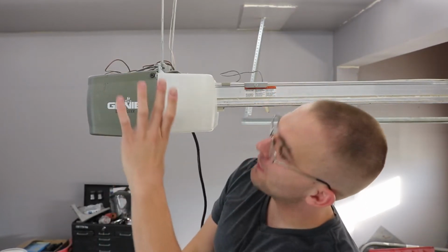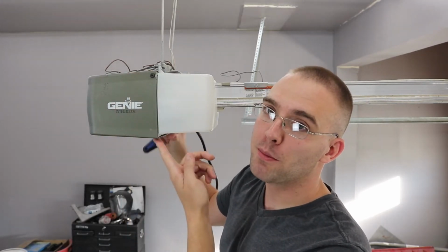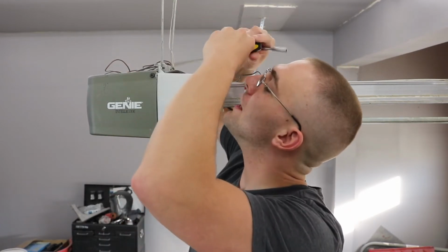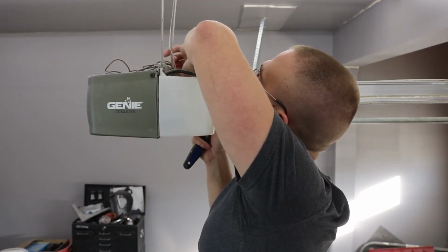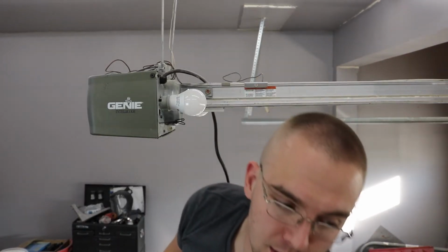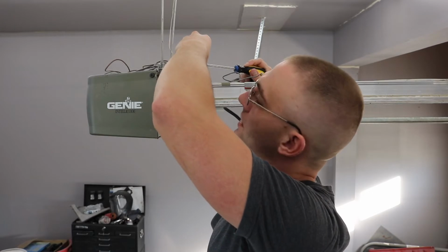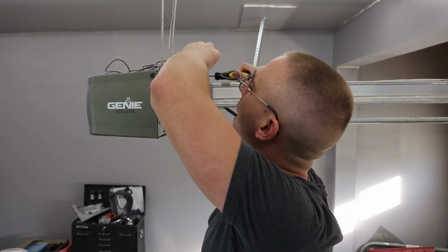This garage door opener has 4 screws for the back case. They're here, one on the side, one on the bottom, and then one on the bottom on the other side, and one on the side, the other side. And then there's 2 Phillips for the light lens. There's the lens. Take that off. The reason you want to take that off is the antenna for the receiver is right there, and you'll need to get that out. There's also a screw that holds the receiver circuit board in.